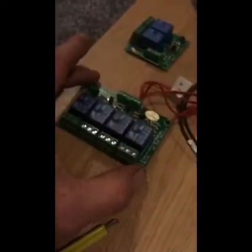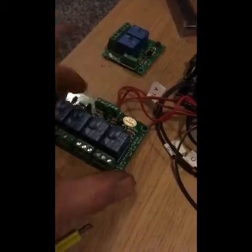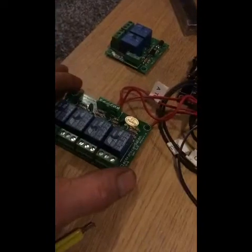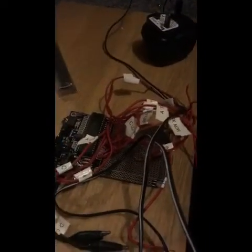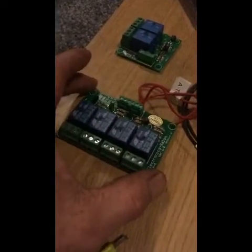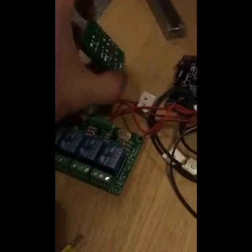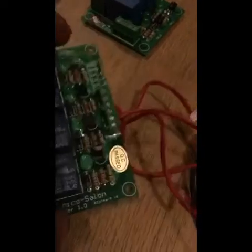This is connected to our output relays. The relays will run at four and a half volts, but really they need a 12-volt supply — old laptop power supplies at 12 to 19 volts will run them quite happily. The PIC chip runs off the four and a half volt USB supply, and the interface relays run off the 12 to 19 volt charger. You can get these relay boards in two, four, or up to eight channels. They show you channel one to channel four, the negative and positive, the ground and VDD, and that's where you put your 12-volt supply.